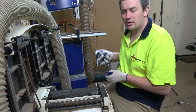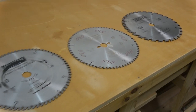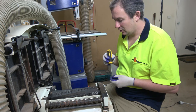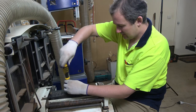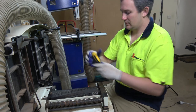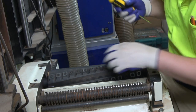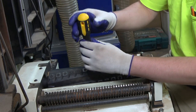If you have a look, they're all nice and shiny now. And now I'm changing over the knives on my helical head in my thicknesser here, because as I said yesterday, we've got a lot of machining to do today. I change these knives out every Christmas — so once a year. Seems to work well enough for me. These are carbide inserts, so they're not super blunt at the moment, but they're also not super sharp.